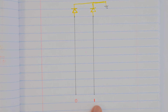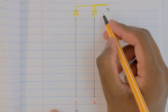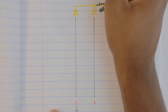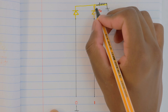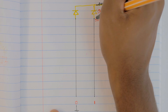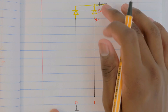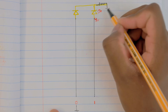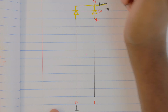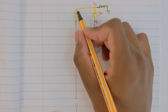These LEDs are connected together and then connect out to ground. If I put a one on a lane, that's basically pulling up to five volts, and a zero should be connecting it to ground. With five volts on the line the LED turns on and drains to ground. In practice it was really about four volts due to power distribution issues, and with a voltage drop of about two to three volts across the LED, you'd have about one volt left across the resistor.